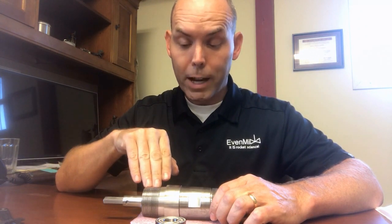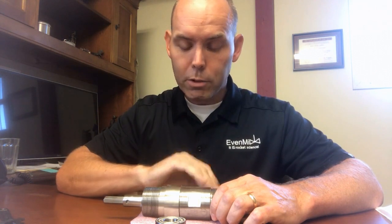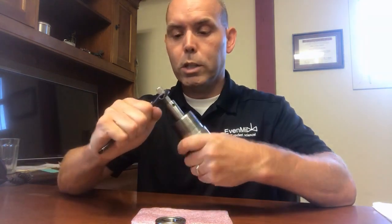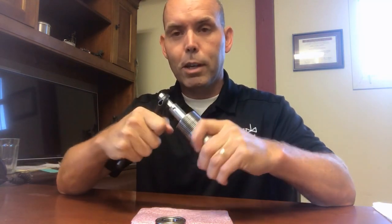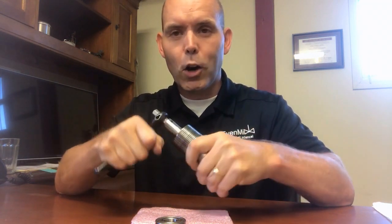In this case a total of 125 to one gear reduction, so it's going in at 22,500 RPM and coming out at 180. If you ever want to turn this backwards, you can see that you can do it — it's not that hard.